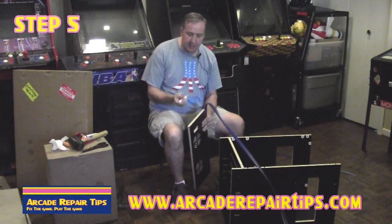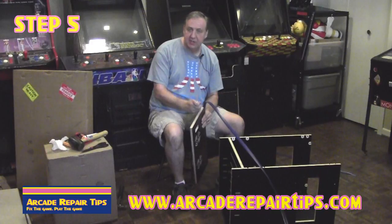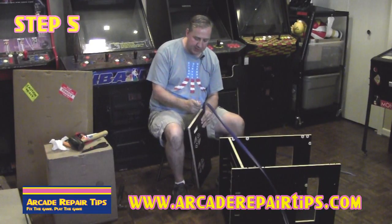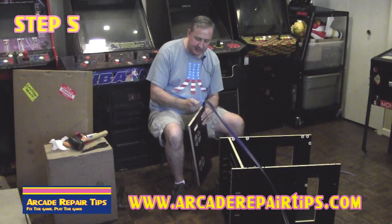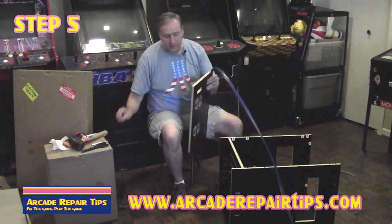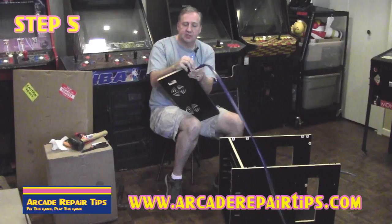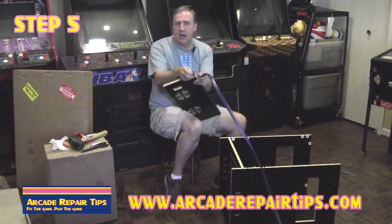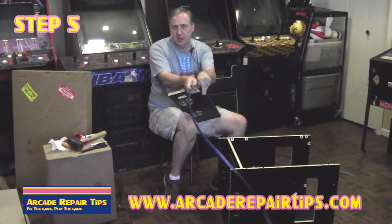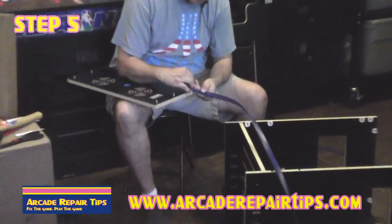One would be that sometimes there's some extra wood in the slot the T-molding goes in that will kind of jam it. If you take a small flathead screwdriver or something, you may need to actually clean out the groove just a little bit. The next thing is, we talked earlier about going around that corner and making the little cuts. Sometimes it's actually necessary to make a bigger cut in there. If we zoom in right now, I'll show you exactly what I'm talking about.